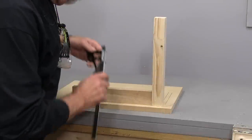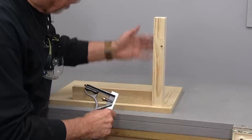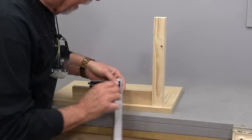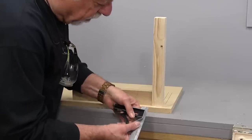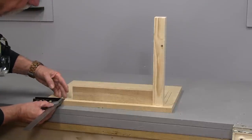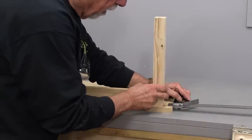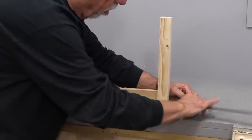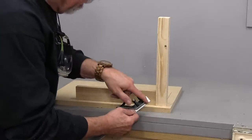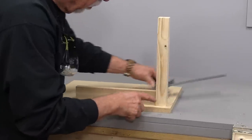For this example I don't have the perfect setup, but imagine this is a table flipped upside down and you're building a table and you need to center the top on the legs. You set whatever distance that needs to be, set the legs on one side first, and then on the other side you may want the same distance. You can use this as a measuring gauge to align your top to your leg set.